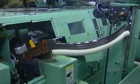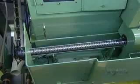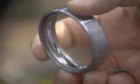Now the rings go for polishing. An abrasive stone lubricated with oil polishes the steel surface until you can see a reflection. Here's the before and after. Next, they coat the rings with thick oil and a fine stone grit, then clean the raceways with kerosene.